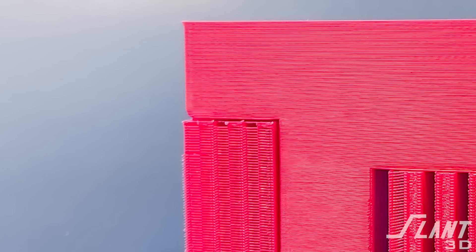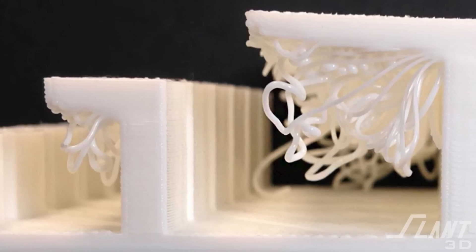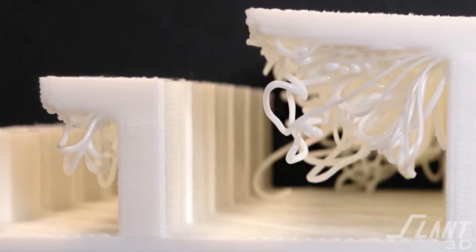Supports are necessary in certain cases. For example, on this piece, when you have a horizontal edge that sticks straight out into the air, it has to be supported. Otherwise, when it's printed and the nozzle is coming along, these edges and bottoms would just drop and sag. You can't have that — you need something underneath it to support it. That is the most common issue. This might be the fingers of a part, some edge, or in this case a structural right turn.